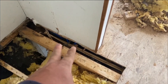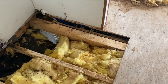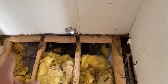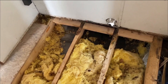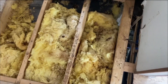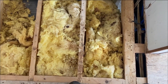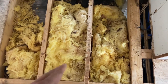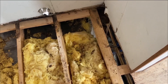You can see our new water lines that we ran there — they go right there and go back that way. So we've got all of our water lines in there, nice and tight. We're getting our blocking in, getting it all the way around. This is all going to be three quarter inch plywood, so it's going to be nice and tight and all that good stuff. We're insulating real good in there because that's all our water lines — we're going to have to get insulation good.